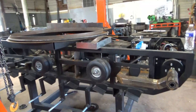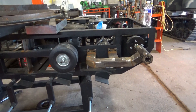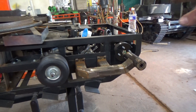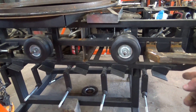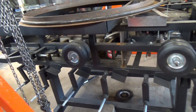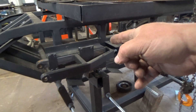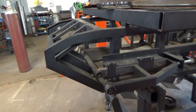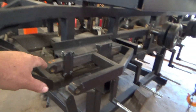Right here is a frame of the units. We got our support arm for our sprocket assembly — that's where the tank gets its power, pulls the tank across the tracks. You see the hydraulic pumps, the hydraulic motors, and our swing arms down low where the wheels go. Got your upper return idler wheels. I make all my own wheels. Right here is your tensioner, front wheel tensioner. This way I can tension the track, adjust it in and out — even though these bolts are tight, this will slide.